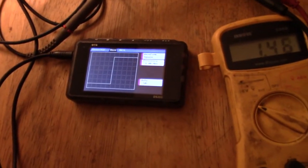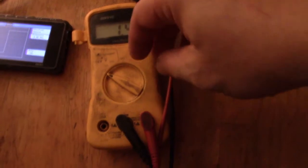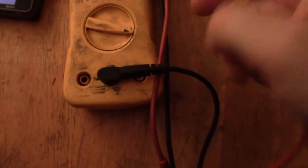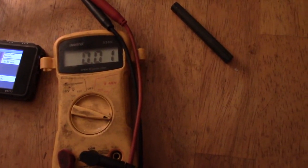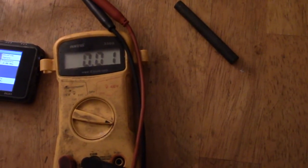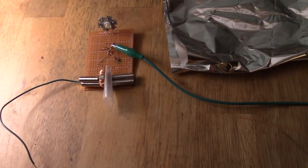There was another thing that was raised, and that was how much voltage this thing is putting out, this DS203, and in fact 1.46, 1.47 volts, and on the milliamps, well, unfortunately on this one and pretty much every other meter I own, I have to go onto the amperage scale so we can just tell to the sort of 5 milliamp marker. So yeah, it'll flip between 0 and 1, so at the moment about say 6 or 7 milliamps. The other meter says somewhere around 5 milliamps because it keeps flicking more. But about 1.44, 1.45 volts is all, and about 6 or 7 milliamps. So really, getting a lot of light out of that anyway would be very difficult to do at that voltage and that current.